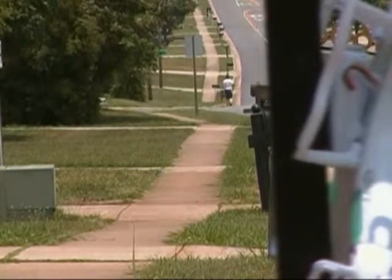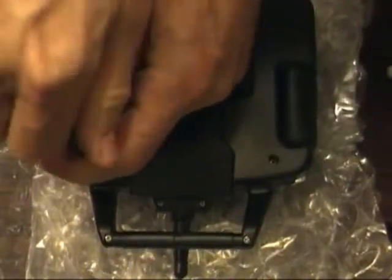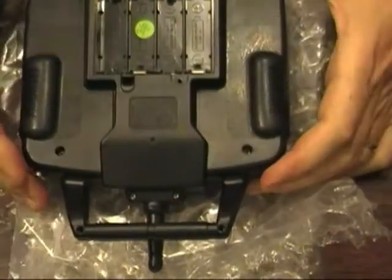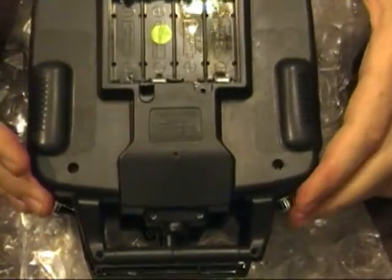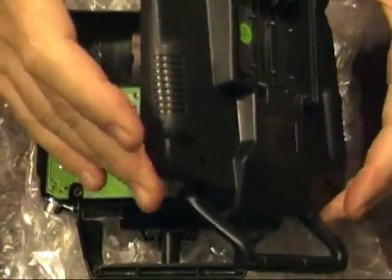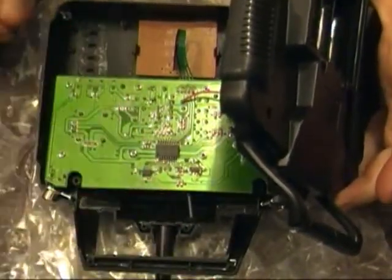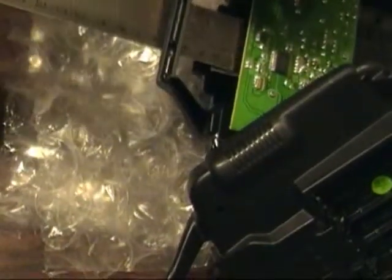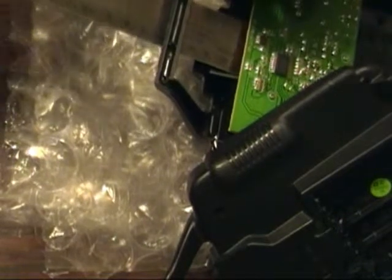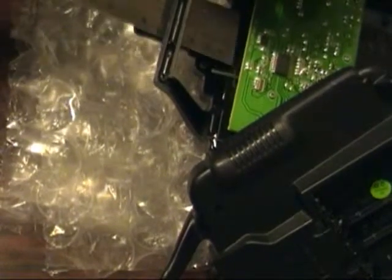So basically, in the stock situation, I got about 8 times 25 yards approximately before it started to blink — about 8 or 9 25-yard segments, or 25-paced segments, which is about a yard. So I thought let's see if we can improve that. I took the back off of the transmitter, and you see that little silver thing in there? That's the antenna. The first thing I did was measure it, because you're supposed to double the length exactly, as close to exact as you can. I measured it and it came up about 2.7 centimeters.